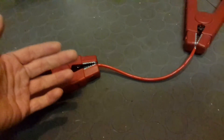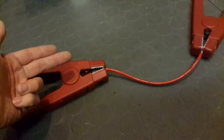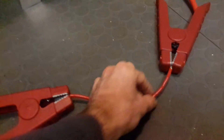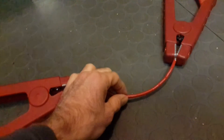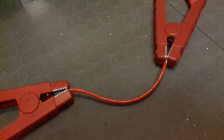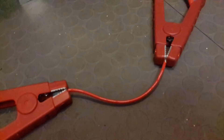The standard for 10 gauge wire is about 1 milliohm per foot length. That means in one foot you will have about 10 watts dissipated at 100 amps — 1 milliohm times 100 amps is 10 watts. That's quite normal. The silicone insulation can sustain up to 200 degrees Celsius, so no problem. I have no problem imagining this wire being pushed to 200 amps without melting or danger — not continuously, but for short bursts like the time it takes to accelerate to 100 km/h on your e-bike.